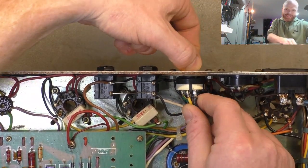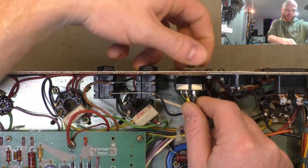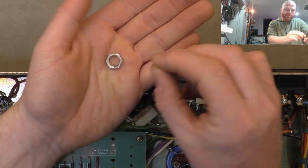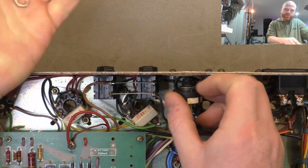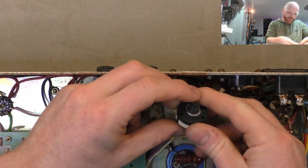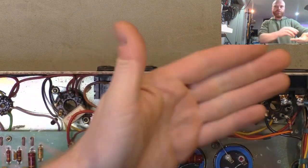Removing the impedance selector - it's finger tight, not that you can do much more than that with a plastic bushing. This is another thing that bugs me: people put the lock washer under the nut. That's not its job - put it between the bushing and the chassis so the actual unit can't move, then put the nut on the outside with a washer. That's what they're meant for. Almost everyone does it wrong. This is an Alpha switch - doesn't tell you the rating anywhere.